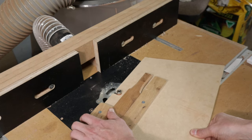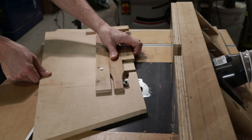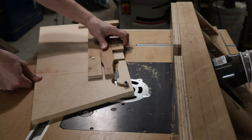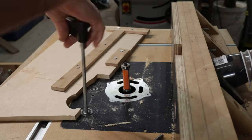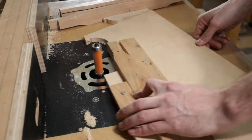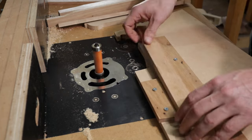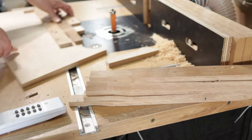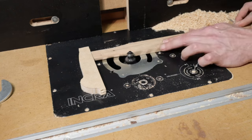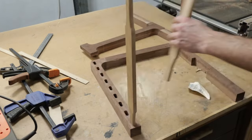I cut one shoulder of this particular slat to a shape that I liked and then treated it as the master shoulder. I can use this slat to cut the rest of the slats' shoulders to the exact same shape. It would probably be a fairly heavy cut on the router, but I reckon I could probably get away with not even cutting out the basic shape at the bandsaw. With a round over bit and a stop block, I can add the final radius to these slats so that they will fit into the mortise cut by the domino.